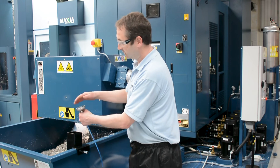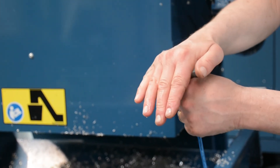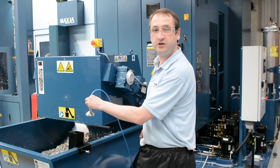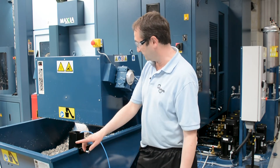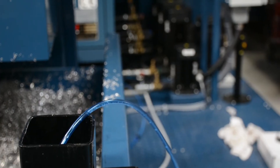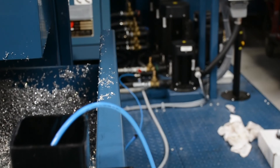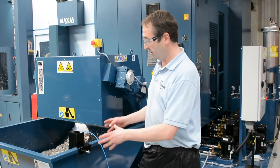It doesn't matter if it's sucking up air — that will just go up into the unit and then back out into the sump. When the bin comes in empty, the vacuum cup goes straight in and it's working all the time. As soon as fresh coolant hits the bottom of the bin, it's straight up into the machine — saving an awful lot of coolant. This bin alone had about 40-50 litres of coolant per shift.